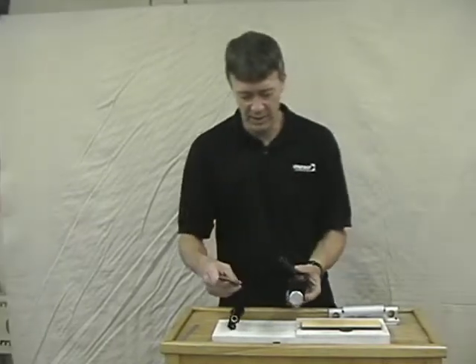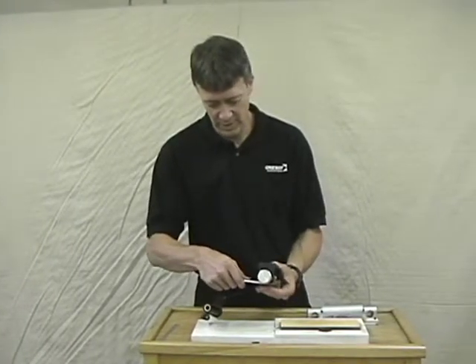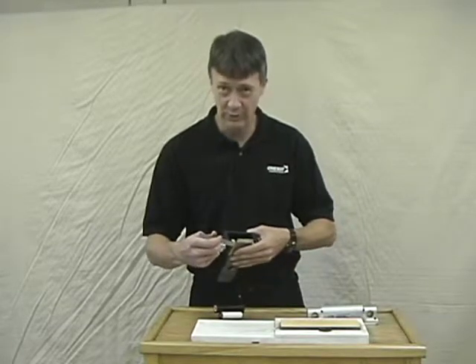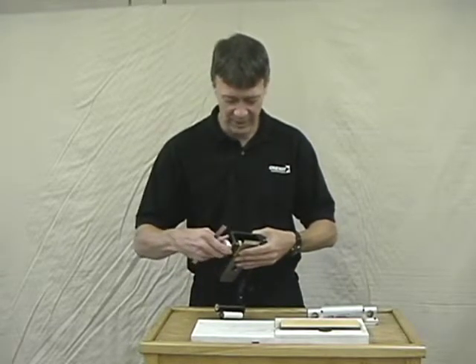To use the jig you should stick your tools out about the same amount every time. It should be around 5/8 to 3/4 of an inch. You want it as close as you can, but you don't want the brass corners to be rolling or sliding on the stone.